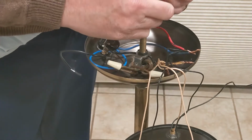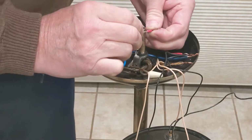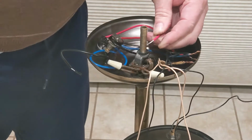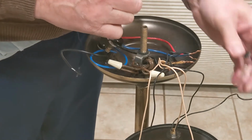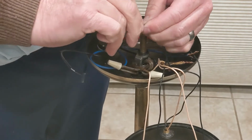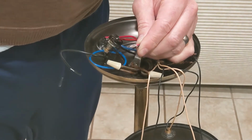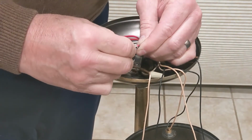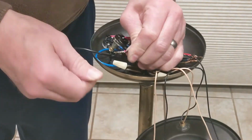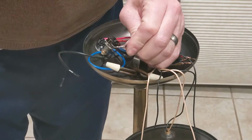And so, these wires are pre-stripped, but they have the insulation left on them. And the reason for that is so you can twist them, instead of twisting the wire before you pull off the insulation. And so what I want to do is then twist these two wires together. And I'll slip a ferrule in here. I think the twist of the old wire made it a little hard to get that wire on. Try it one more time here.